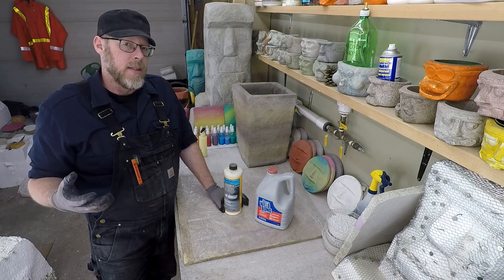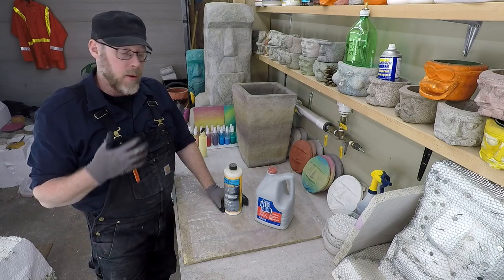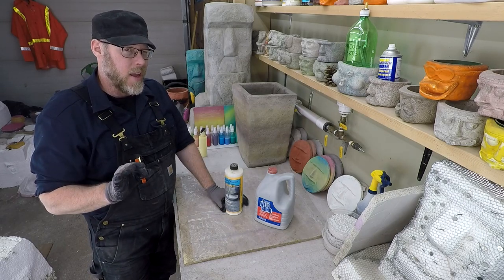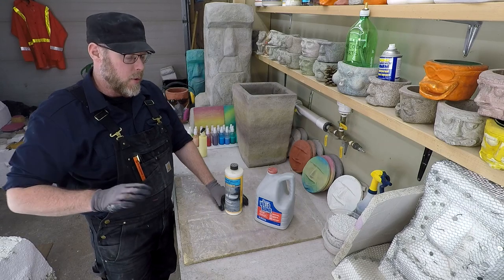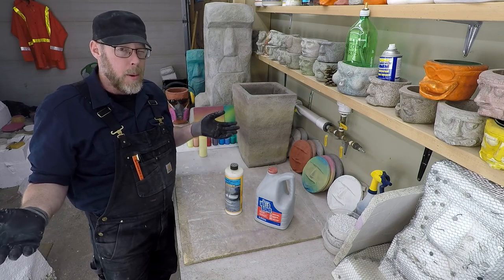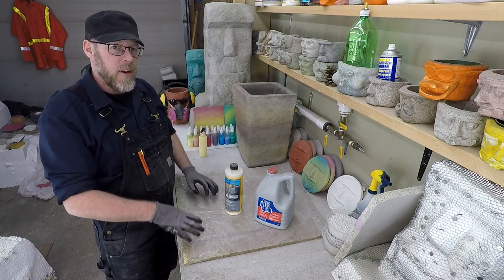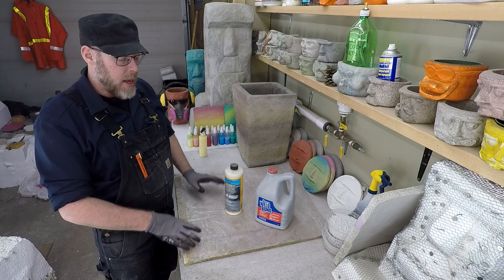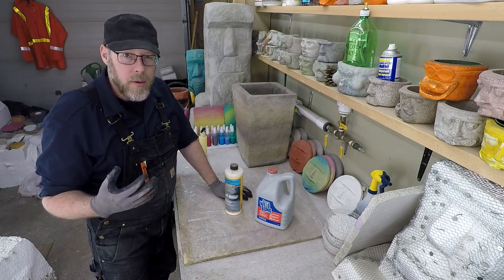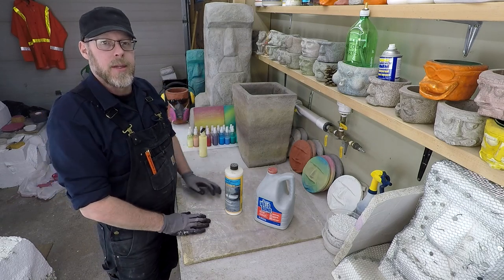These products here are modified such that they will not continually re-emulsify. They're only liquid one time — we make the concrete, and once they're hard, they stay hard. That's exactly what we're looking for. So yes, you can add glue to concrete. You shouldn't overdo it — you could probably use more than 25%, but you'd likely start running into problems. So 10% to 25% of your liquid content replaced with a modified PVA product will give you stronger concrete that repels water a little bit better and feels a little bit different on the trowel. I hope you found this information helpful.